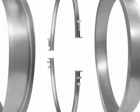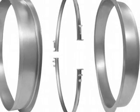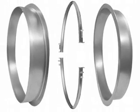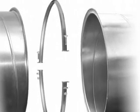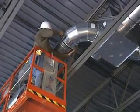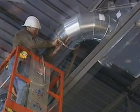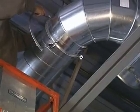Complete sets consist of two flanges and one barrel clamp. This enables the flanges to be installed in the field on existing or raw pipe. Or, during production, the ends of the pipe and fittings are turned out to create a 5/8 inch flange, allowing quick and easy installation without having to install loose flanges. Both Easy Flange Junior connections use the same style barrel clamp to complete the job.